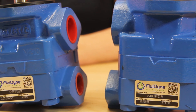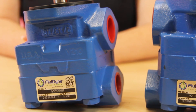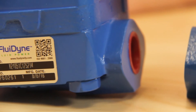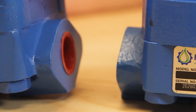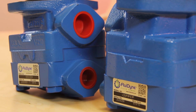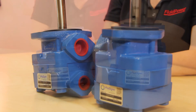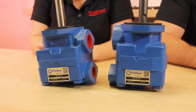Pressure-induced radial loads are balanced by diametrically opposed internal inlet and outlet pressure chambers. This means the bearings only have to carry the external load. Low vane tip or ring loading allows high pressure operation. The high speeds are possible because the inlet flow paths are designed to give uniform oil acceleration, thus better filling, particularly at low inlet pressures.